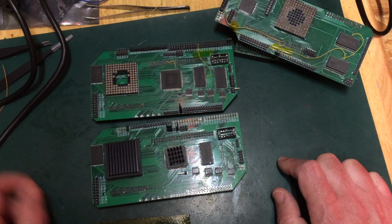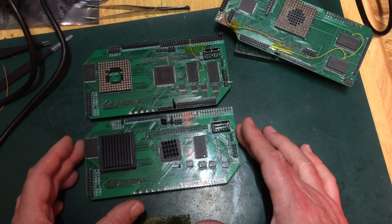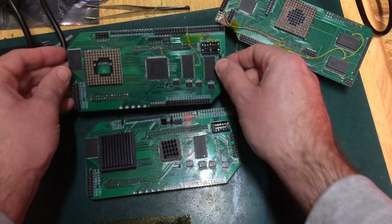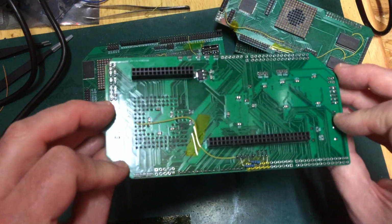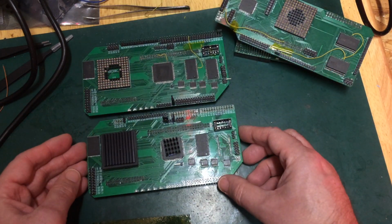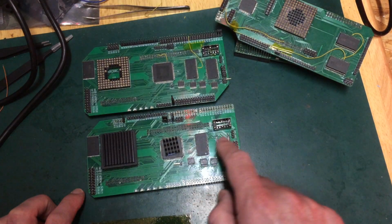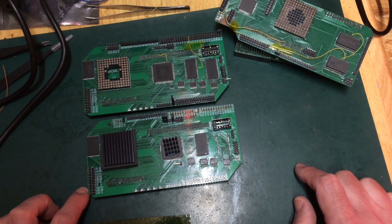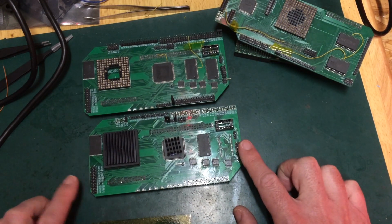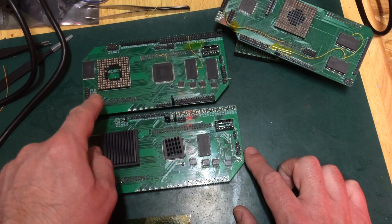and I've got some status LEDs down the bottom, and that was so successful that I built a second version of that. But you see there's still a couple of bodge wires and things on there, quite a few on the bottom. That was so successful I built a second version, managed to reduce the bodge wires down to a smaller number by planning ahead there. But this one was just really an evolution, make sure that I could build a second board. That one worked, that one was perfect, 128 megabytes, full speed.